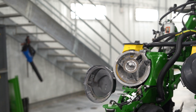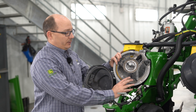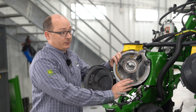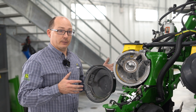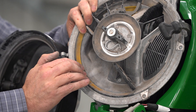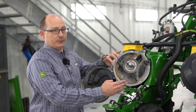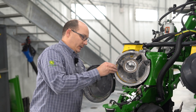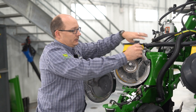The next portion I'm going to touch on is your agitation strips. You have the ability to run two separate agitation strips. Every crop is different, so look in your operator's manual when you're switching crops to find out what agitation strip is needed. In this case right now, we have the smooth agitation strip in place. Inspect the agitation strip — they do wear; they are a long-life item, but they do eventually wear. When you do change out your agitation strips, let me pull the meter off here to make it a little easier to access.